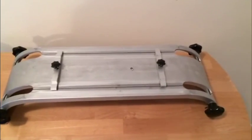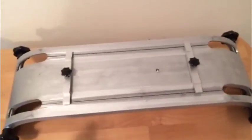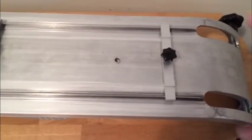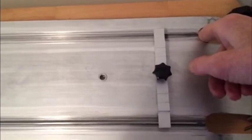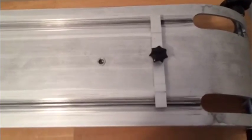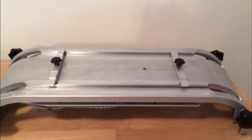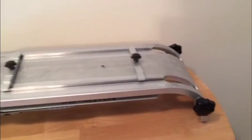It has to be precise in order to get a good edge. These guides come off when you're actually sharpening, but they help get the skates in exactly the same position on the jig. We make sure the blade height is the same for both blades, and we want both blades in exactly the same position fore and aft on the jig. I place my finger here when I put each blade in and bump the blade up to my finger. Now both blades are in exactly the same position on the jig, and their rockers are identical.